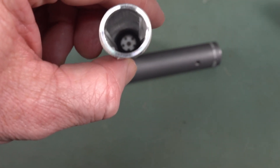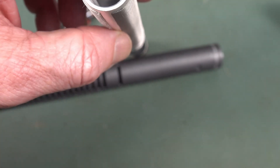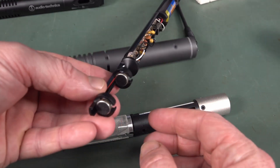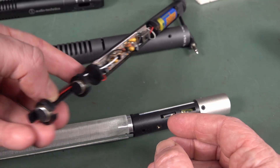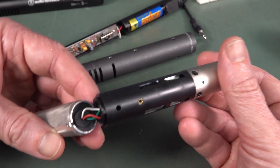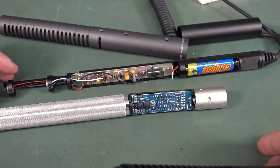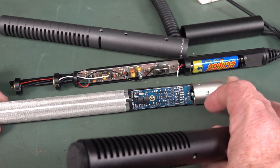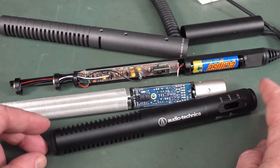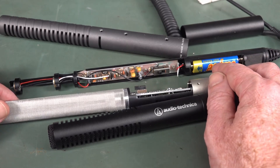So there's nothing fancy in that — that's just a screen there. The microphone capsule is right down in there. The Rode's going to have a better capsule, which is why it sounds better than the smaller inserts inside the Audio-Technica here. And there is a cost difference — the Audio-Technica here is 99 Aussie bucks and the Rode NTG1 is about two and a half times the price at around 250 odd bucks. So yeah, there's a significant difference — you're paying for extra performance in the front end plus the better designed capsule.